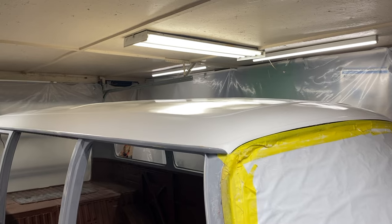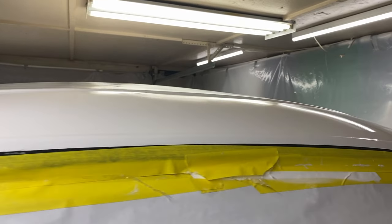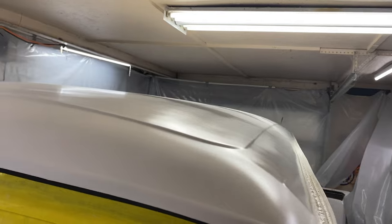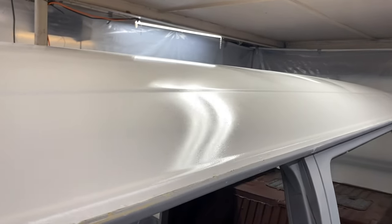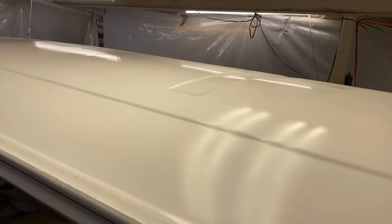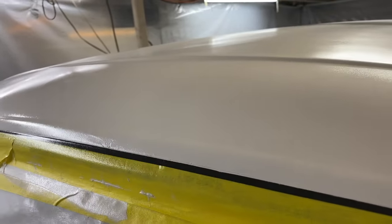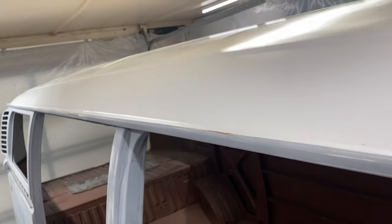Little update: I've got two coats of lacquer, two coats of clear, wet sanded to 1000, and then did another coat of clear. It's got enough clear on it now that I feel comfortable that once this is cured — I'm going to let it go for a couple weeks — I'll be able to cut it back and buff it out fairly shiny. Not too bad for the first time spraying lacquer. I can't wait to see it when it's all cut and really shiny. I'm excited to get the red on here.